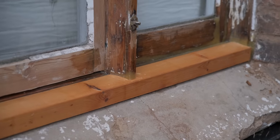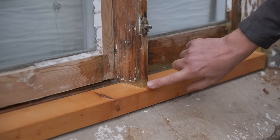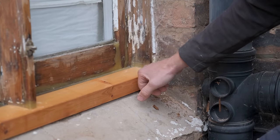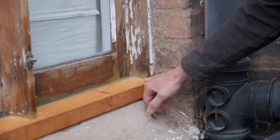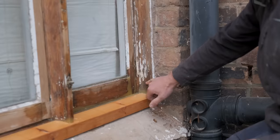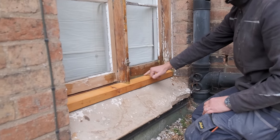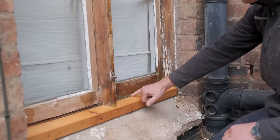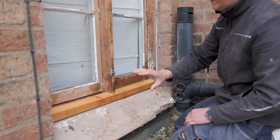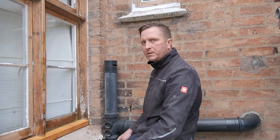Here's a repair that I've done. This was quite a nice one actually because it wasn't as bad as some of the others. This didn't require splicing but it's kept the profile around there beautifully. I've done it right into the corners so that you don't get water coming back in. In these corners — same on sash boxes, they rot terrible — you need to get in there with the resin, you need to get in there with the two-part liquid. You can see this dark patch here; it's not water, that's the two-part liquid. And it stops that timber from being porous again.